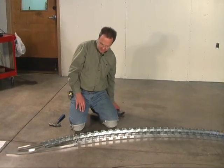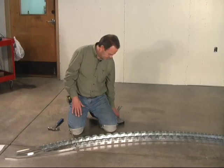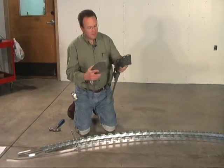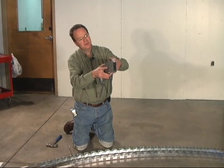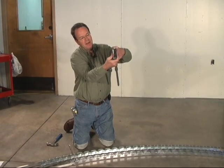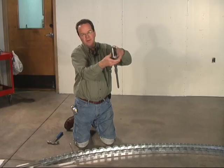This is where it gets a little tricky — we need a right and a left hand of each rib. The reason is that at the top of the dome where we put all these ribs up into the compression ring, they need to nest together so that they only occupy half as much space, so that you can fit all of them into the little compression ring at the top of the dome.